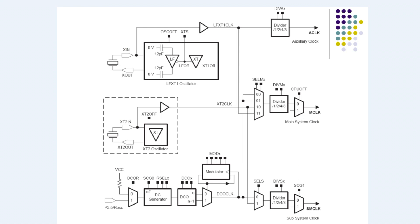Here's a block diagram of the internal clocks for the MSP430. At the top we have the low frequency oscillator — a 32.768 kilohertz oscillator — which gives us the A clock, keeping power consumption low. The next two clock sources can provide the M clock, the main system clock, or the SM clock, the subsystem clock. These come from either an external oscillator or a DCO, a digitally controlled oscillator. If you want to master the MSP430, it's imperative to study the datasheets and understand all the clocks and clock buses, because that's the key to its low power consumption.